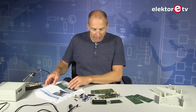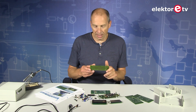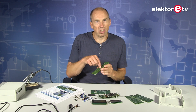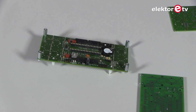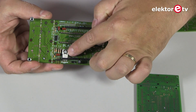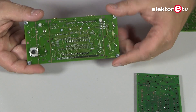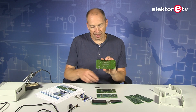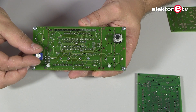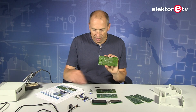This is very important. You have to start with that, and especially if you select the 28-pin processor like the ATmega328 used on the Arduino, because there is a solder jumper under the 28-pin controller. Here we have a board configured for a 40-pin AVR with a power supply, a buzzer, and an LCD connector that goes on the solder side because it's meant to be used like this. Pushbuttons also go on this side — this is the human interface side. Rotary encoders and the display go on the solder side as well.